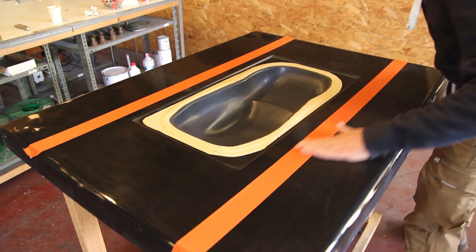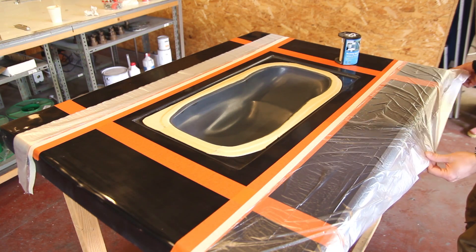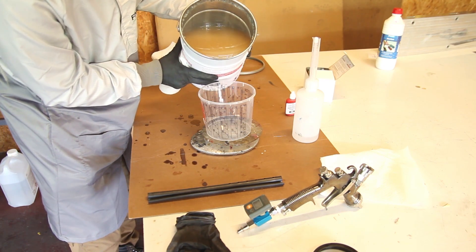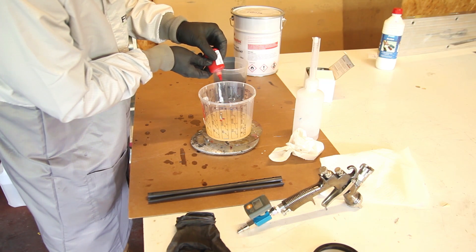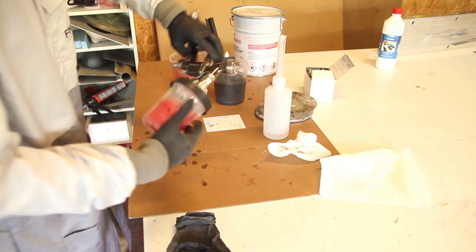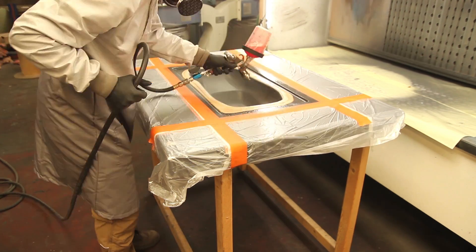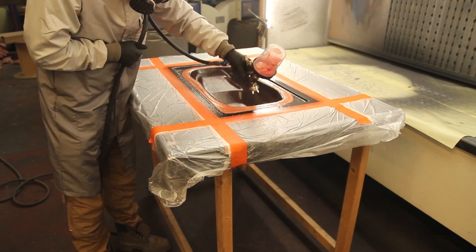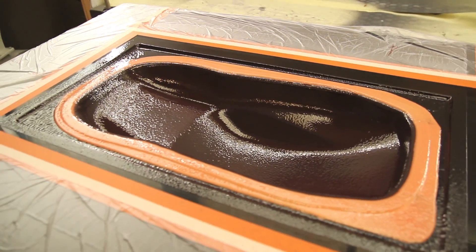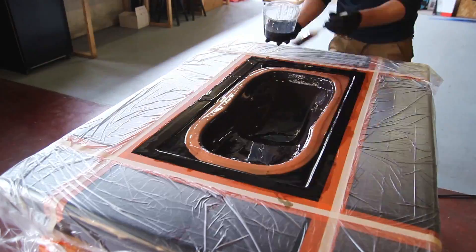I'm taping off everything I don't want gel coat on, because we'll be using a polyester gel coat on the inside — just over the car part area — to get a nice pinhole-free finish on the inside. It might look confusing: it appears orange in the cup, but if you spray it into a mold and infuse carbon fiber over it, it comes out totally clear. I've added some red tinting pigment just to be sure I can see how thick and evenly it's applied. You can see some orange peel on the surface, but that back surface will get filled with polyester resin.